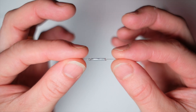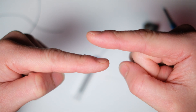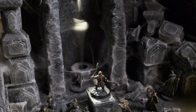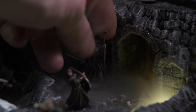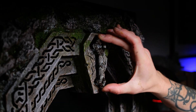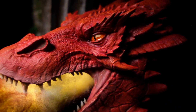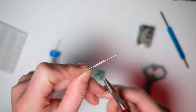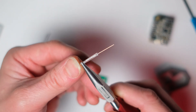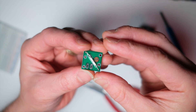This is your standard reed switch, and for anyone who doesn't know, a reed switch is basically a glass tube which holds two wires apart. When a magnet passes over the top the two wires connect together, completing your circuit. By including a reed switch in your circuit it enables you to do all kinds of cool things like adding smoke or lights to your terrain simply by the use of a magnet. In this project I've included my magnet in the key to Erebor, meaning that the key to Erebor is what makes Smaug wake up and breathe fire. Reed switches are quite delicate so when it comes to bending the legs you're going to want to pinch just beside the glass bar and bend the leg carefully so you don't break your glass bulb.